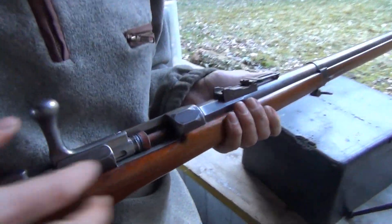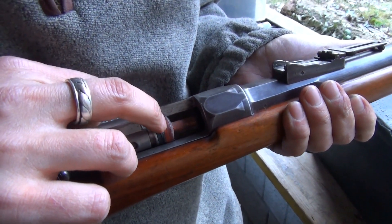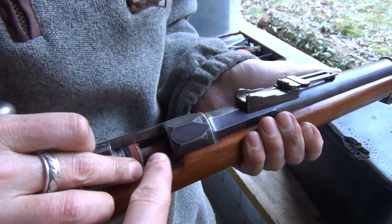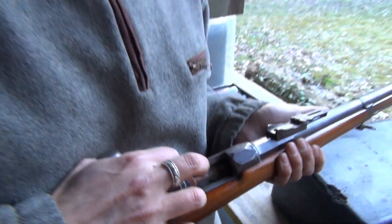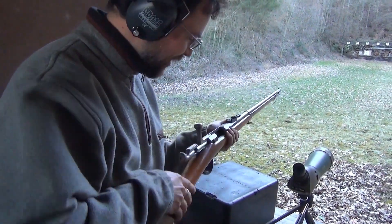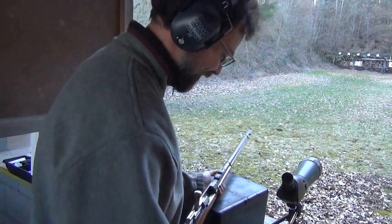You can see the seals there. There's a bit of gas leakage past the first one and then the rest are clean. You've got all the sulfur on the prong there. The red is a good sign that you've got good combustion there. And there's no debris in the chamber — so chamber another one and see if it just goes.